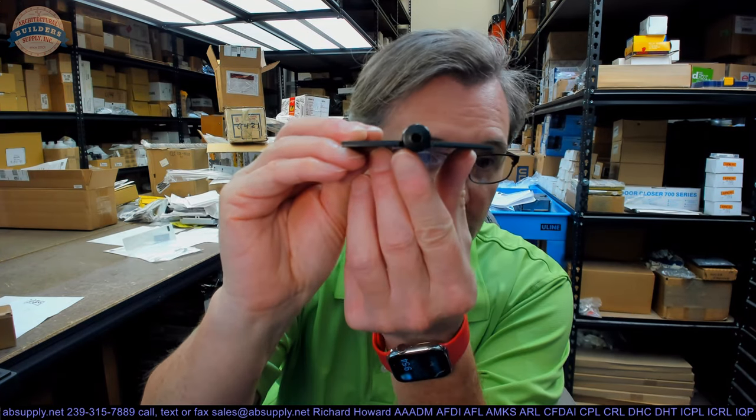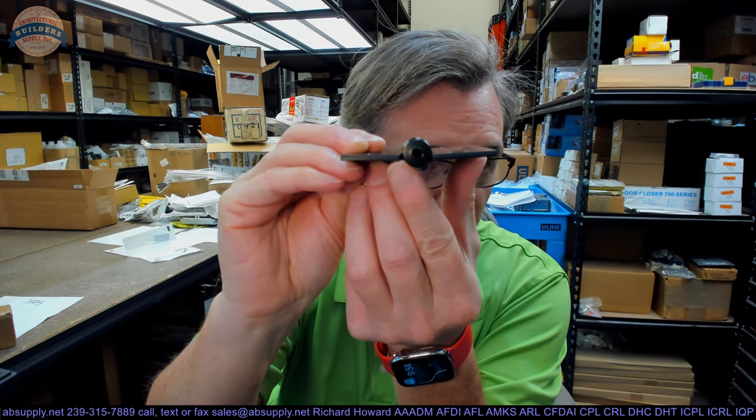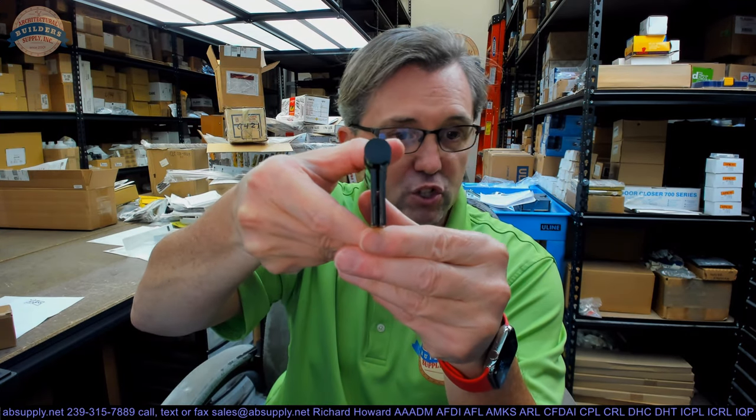This is a full mortise hinge. You can see from the swag on the hinge leaf here and here that when those leaves are brought parallel, they're meant to be mortised flush to the edge of the door and frame. But more specifically, you want a 3.5 by 3, is the bottom line. 3.5 inch is a really good size for a 1 3/8 thick door. Pretty common.